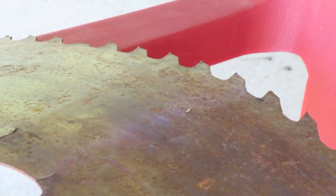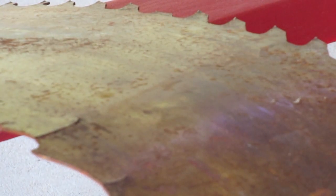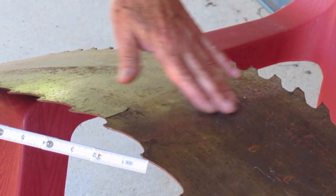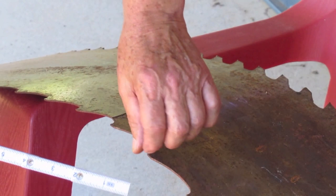So this is the cutting side and this is the back side. The log would be advanced past the blade and then backed up. If there are any splinters, rather than pulling the blade off the saw, the back teeth would act as a little bit of a cutting factor to destroy any splinters, so there wouldn't be a backward force on the blade.